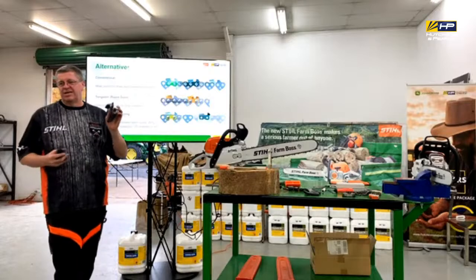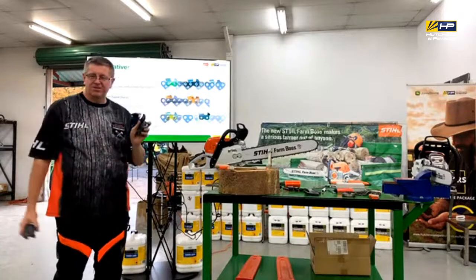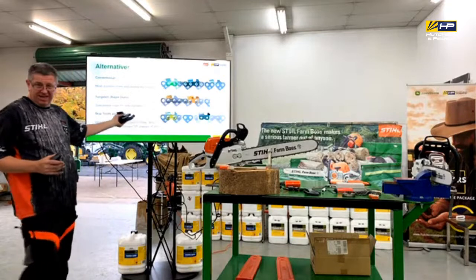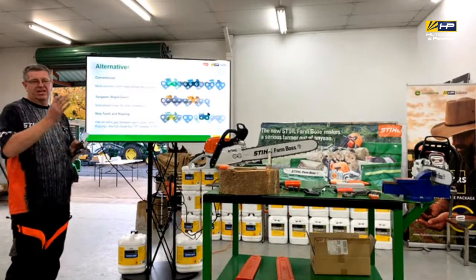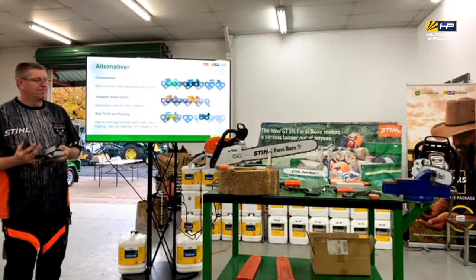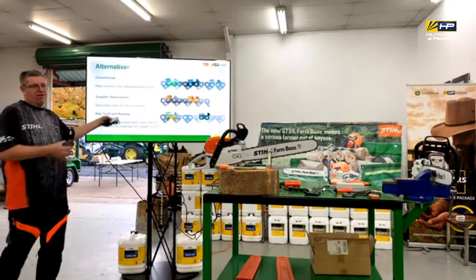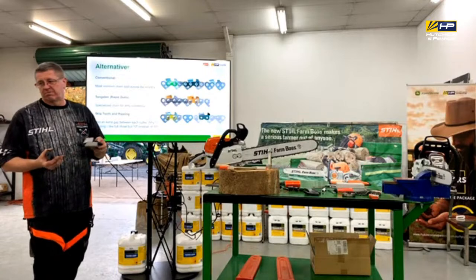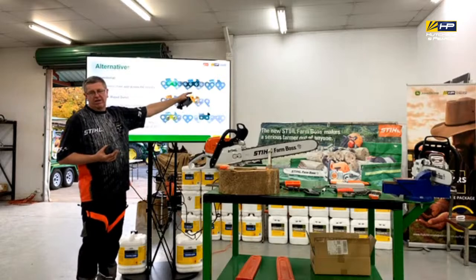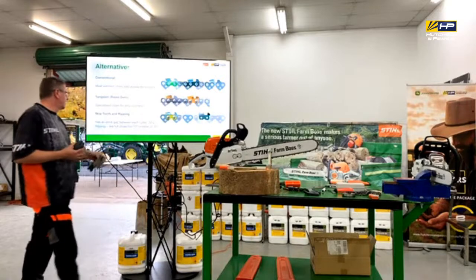If you're using either one of these chains, okay, dirt is the enemy of chains, all right? So you go through, do a cut, you nick a bit of dirt, she's all over, you'll start having problems with it, okay? The rapid duro chain, you've got a little bit more give in that it can tolerate a bit of dirt before it will actually start to slow up, okay? There are specific requirements as well as far as how you look after and maintain that chain also. Because that cutter tooth is going to last a lot longer, but the reality is it's mounted to a normal chainsaw body. So you've got to make sure that you maintain it as well.